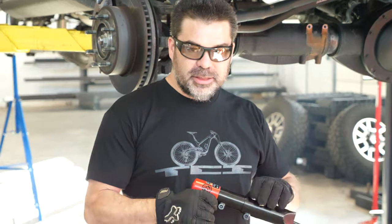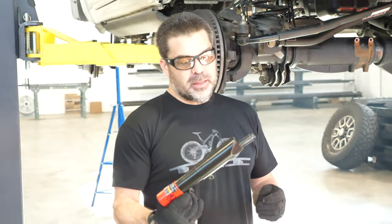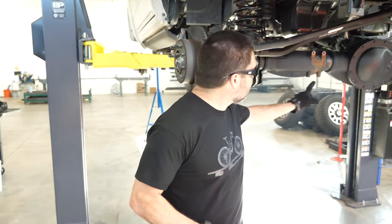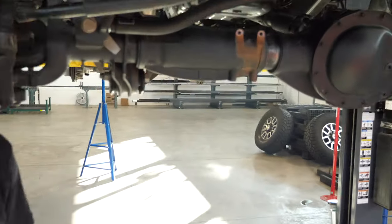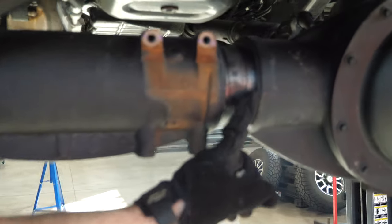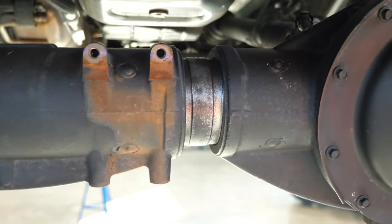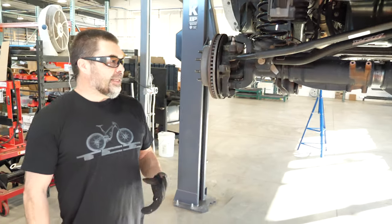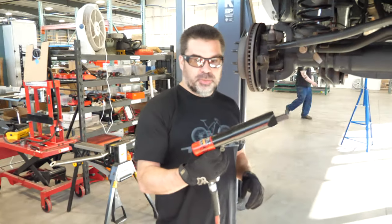We're going to use a few things to get all the paint off of the axle today. The needle scaler looks pretty good for getting into the tight little cracks. See if you can get in there and show that metal — it really gets in the corners and gets you down to bare metal. You can also use a wire wheel, a sharp chisel as a scraper, a flap wheel grinder — anything you need to do to get in there. But these are pretty sweet.